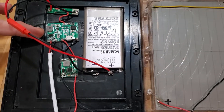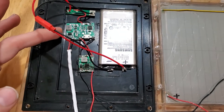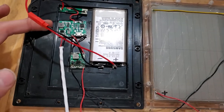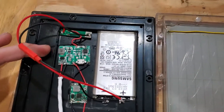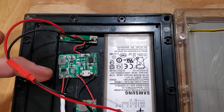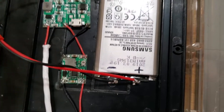This also steps up the power from the battery. In this situation I need six volts. Some other cameras use nine, some use 12, and I can use the same circuit and just rotate the little dial to whatever I need. This one's also got an adjustment screw — a 10k potentiometer right there.